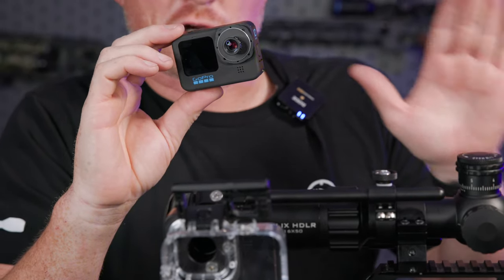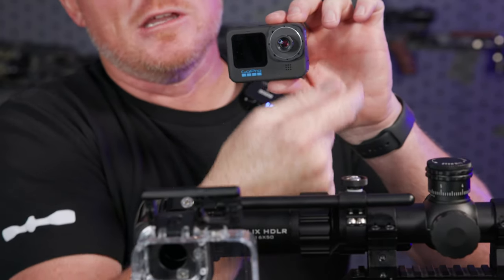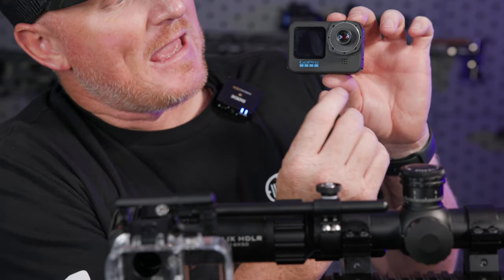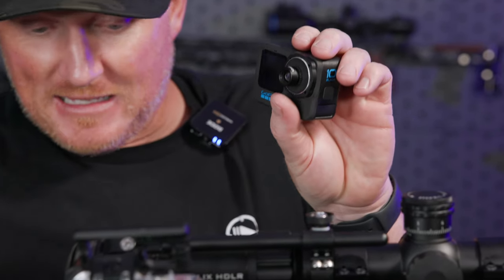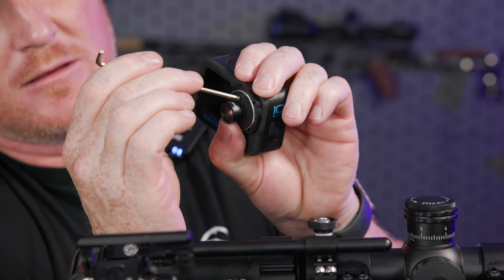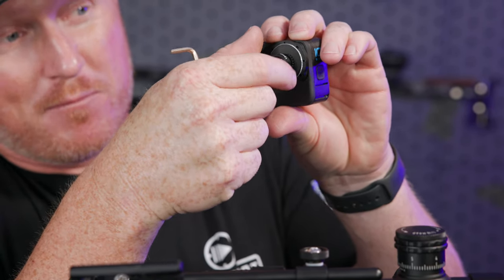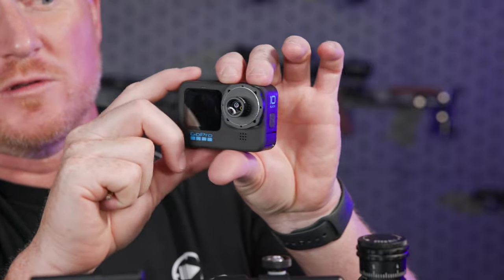If the crosshairs are crisp and the image is blurry, you've rotated too far clockwise to the right — you need to go counterclockwise just a little bit. I'll move it in just little bits when I'm really close. Before I tighten it down, I'll loosen it just a little bit, then take an Allen wrench and lock this ring. Then the last part of locking it, I just twist the lens and that locks it down. So I bring it back counterclockwise just a little bit further than necessary, lock the ring, and then tighten this down so it doesn't move.